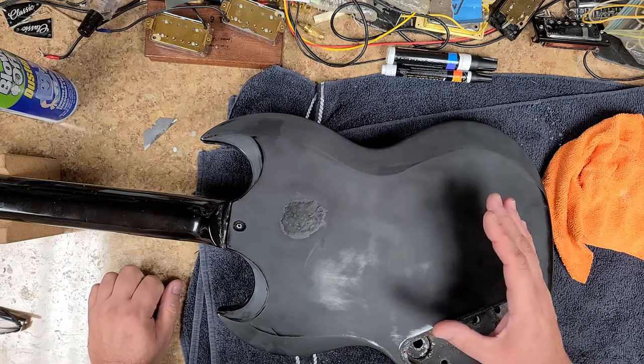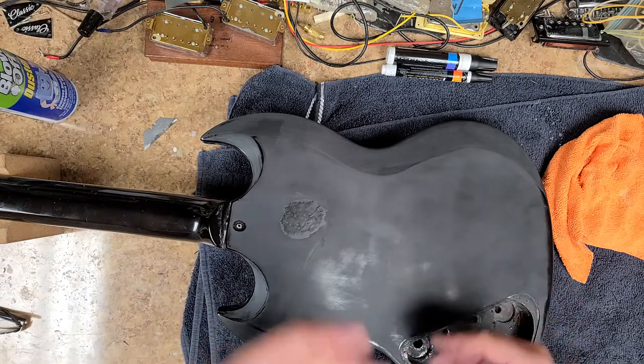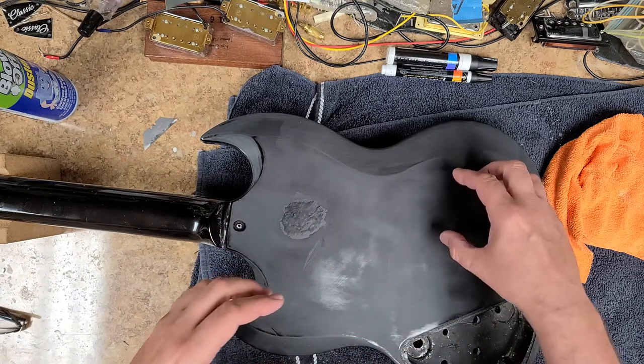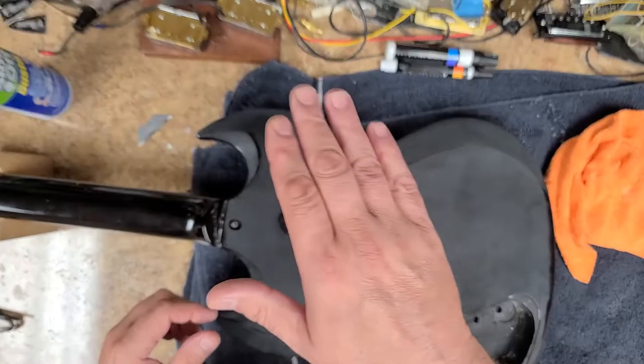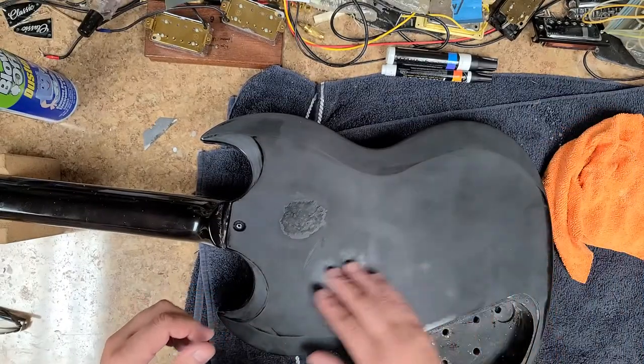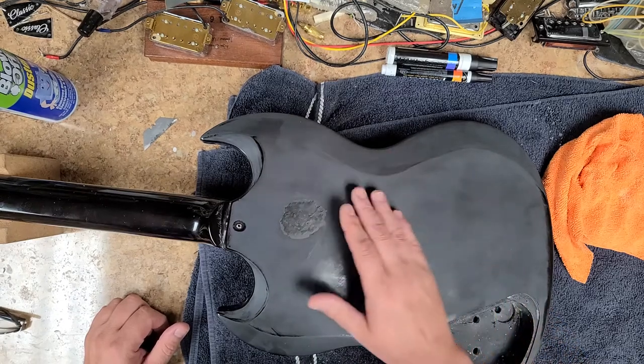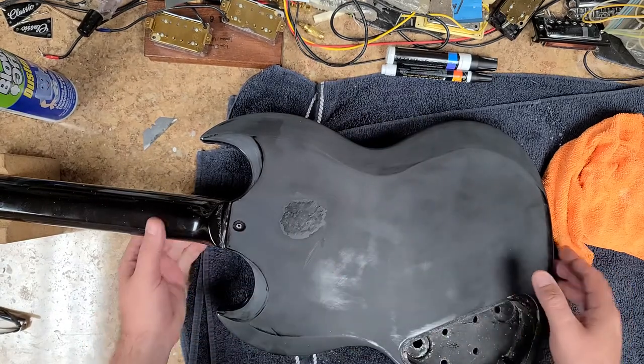That'll all be filled in. And once the epoxy resin, like I said, gravity takes over until it cures, it's going to puddle in the low areas, and it's going to look flat. It self-levels. On the high spot, you'll still see that high spot. It'll kind of be a hump right here, and that you don't want.